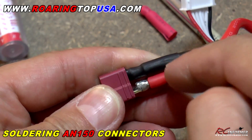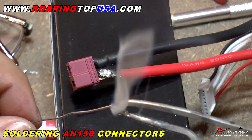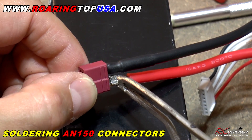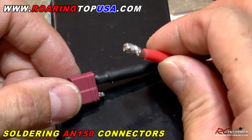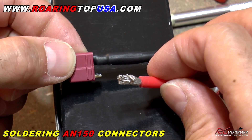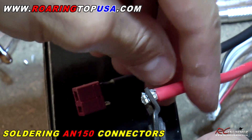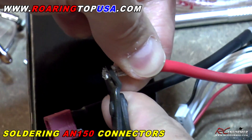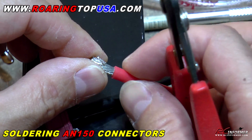Now you're ready to desolder this tip. Desoldering is really pretty easy. Once you get the iron hot enough, put a little bit of solder on — mostly just to get some rosin on there — and then it really desolders usually just this simple. As long as it's not a real powerful connection, you can usually just heat up your wire and it'll come right off easily. The nice thing is you already have a pre-tinned wire tip that will fit right into the connector and you're ready to solder the two together. One trick I like to use instead of stripping insulation is to grab it with a pair of pliers just to grip it, and push your insulation back. Once you get that insulation back, you can go ahead and solder this onto the new tip and then push your insulation back on.